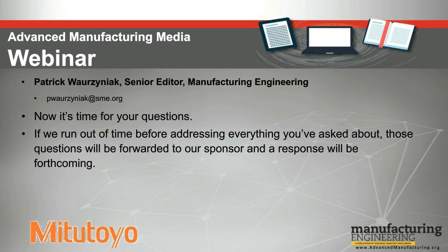So we covered WLI, points from focus. There's other sensors out there than the ones we described here, and of course, they're going to have their own types of principles along with them, but there's laser type scanning on platforms that are out there. There's even radar now for doing macro type measurements. So that's what I meant by just isolating these four and comparing them to each other. However, there are other non-contact methods out there.